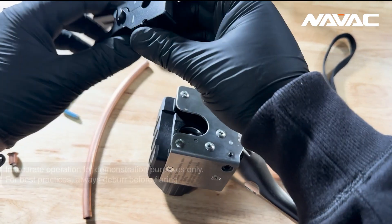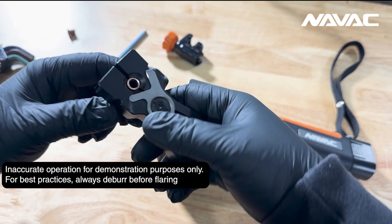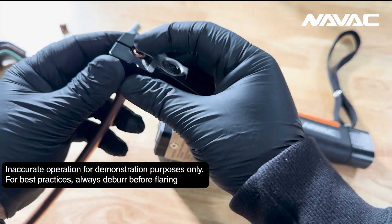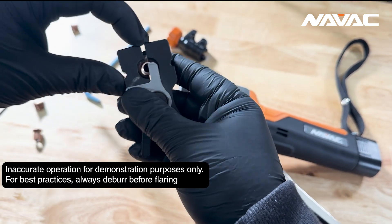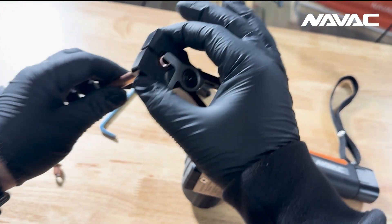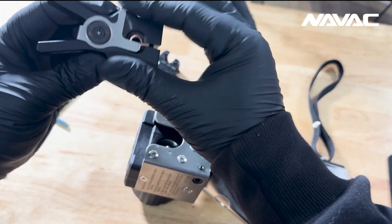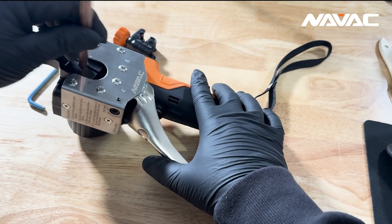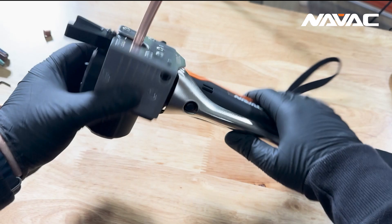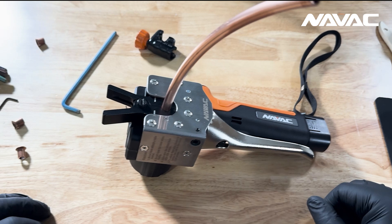Let's go ahead and do a piece of copper while we're here. We open our clamp, close our depth gauge, and make sure that we are at just the right depth to get a perfect flare. You'll see there's a little gap here that almost looks like the clamp isn't properly grabbing the copper — it is. This is the play needed for that locking mechanism to clamp shut and get a real positive grip on the copper. Once we get this seated in, we've adjusted to where we can now lock this copper into place. One-button operation — it's going to perform our flare.